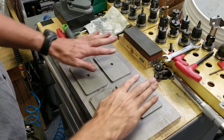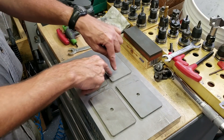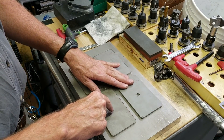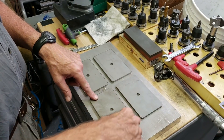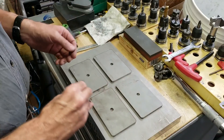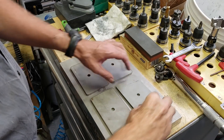The way I've decided to set this fixture plate up is just like this. The two on this side will be doing the counterbore. I'll have a quarter-twenty tapped hole here with a bracket coming across to hold these down. It'll machine the counterbore, then move over here where I'll have quarter-twenty holes tapped and bolted down. Each cycle, two finished products will come off. I'll be machining four pockets for these parts to locate in and keep them from shifting.